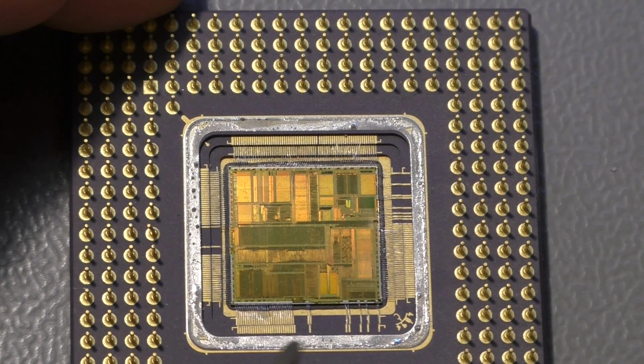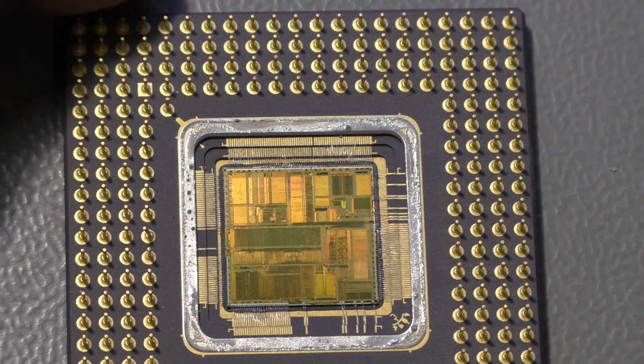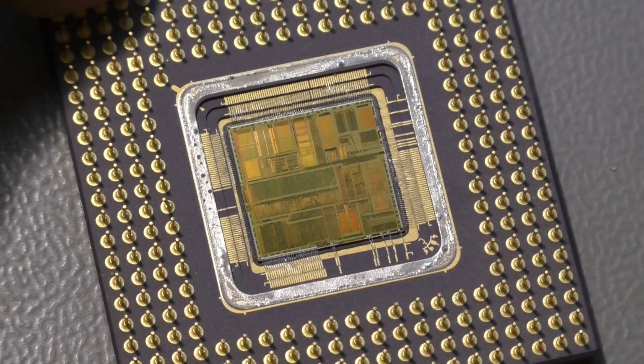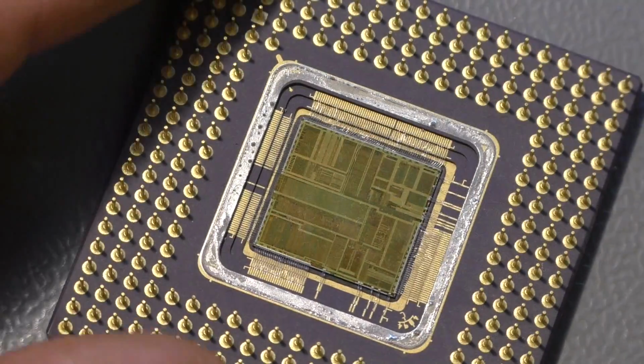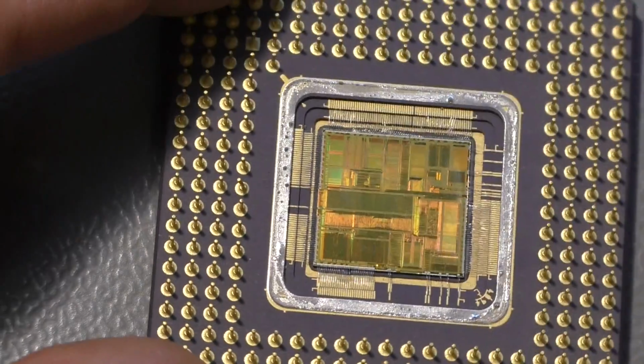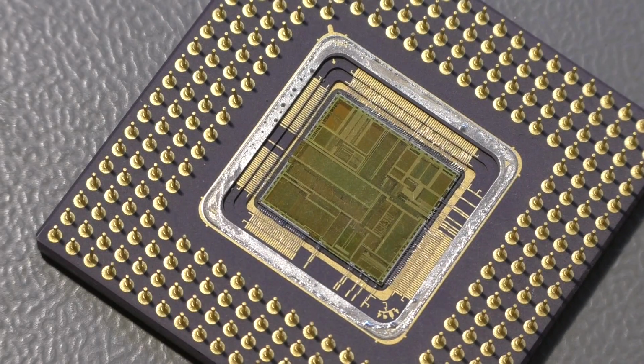and the silicon die is soldered to the heat spreader with indium solder, because it has a very low melting temperature, and maybe because of other properties. Well, let's see if we can have a look at this through the microscope. Well, I'm sorry, but I think you can't see the indium solder here from this side, because it's underneath the chip, which is here,